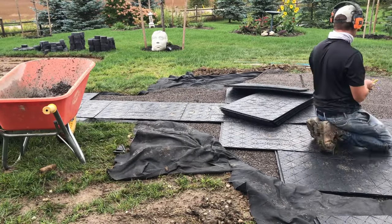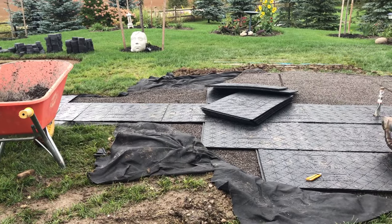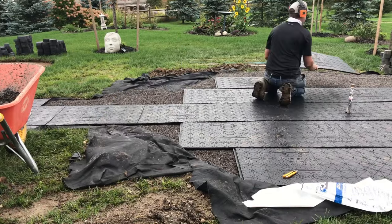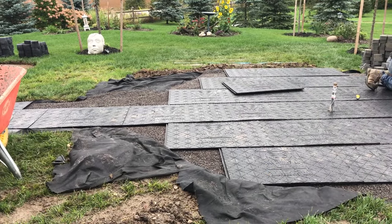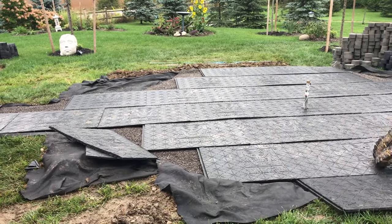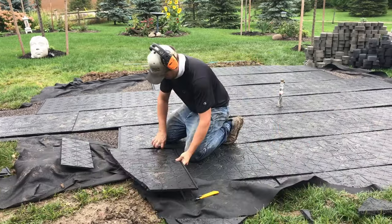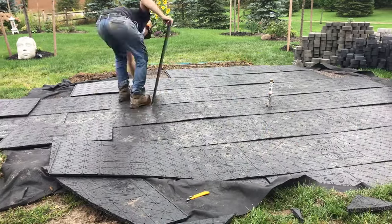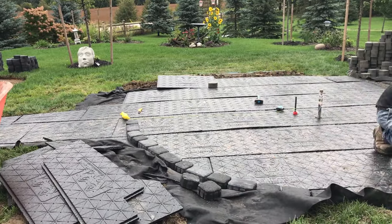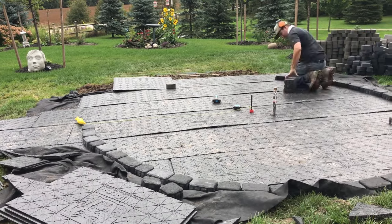Another excellent application is side walkways. We would not opt for an open graded base for a side walkway because it's right up against the foundation — we don't want water settling right beside that foundation as it percolates down. A synthetic base really helps in being able to direct water away from that foundation, because when water goes through the jointing material it hits those paver base panels and follows the slope away from the foundation. There are also little drainage holes in the panels that allow water to percolate through.